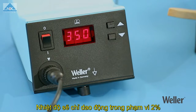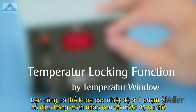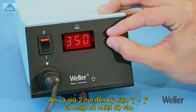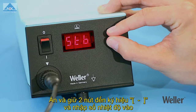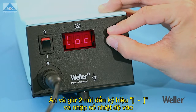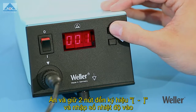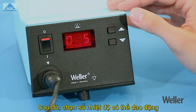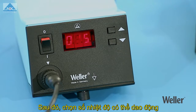The temperature is accurate to within plus or minus two percent. You can also lock the temperature within a specific range by entering a temperature window. Press both buttons to navigate to the window symbol and then specify the temperature window. Then lock the station. The lock temperature represents the middle of the adjustable temperature range.